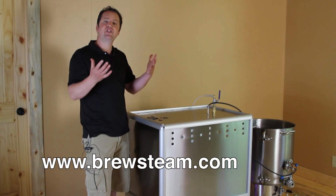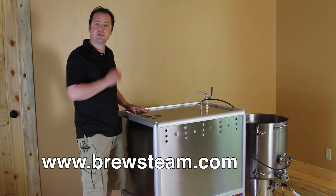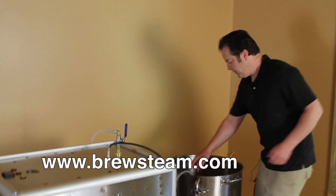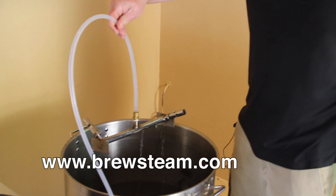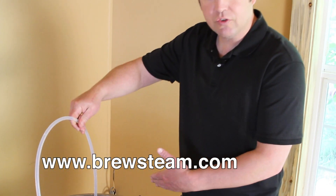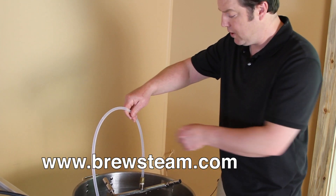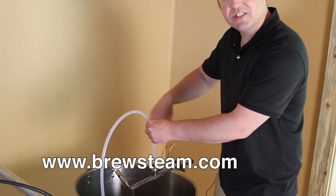We're not steaming on the outside of the jacket — we're actually steaming from the inside out. Let me show you the injection system first. We're using a Venturi system. These are Venturi-style nozzles. You'll notice that they're angled in a certain way so that it keeps the liquid inside the pot rotating at all times. We've also got some additional holes that keep the turbulence in the center of the pot as well.